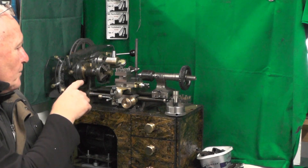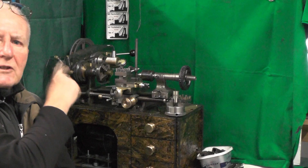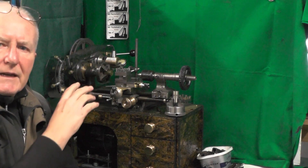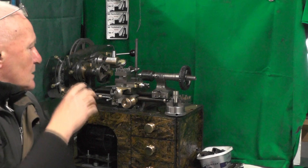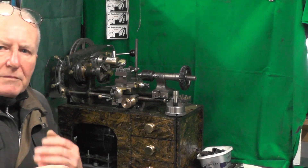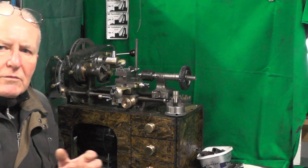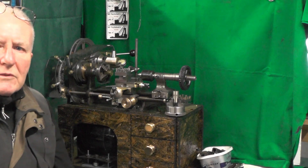This time it's the cone clutch I've made — the clutch is actually slipping. Because everything is so small I can't really get a stronger spring in it, so what I've thought of doing is taking the cone out of the clutch and machining it to put some friction material into the cone. I'll bring the camera over and show you what I'm talking about.